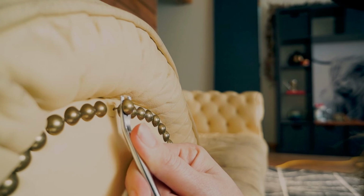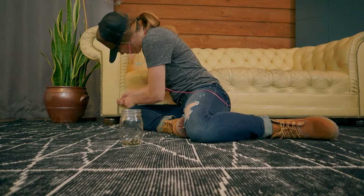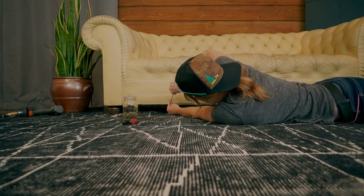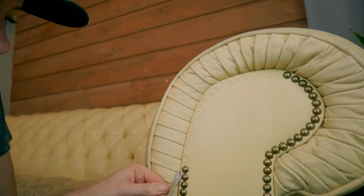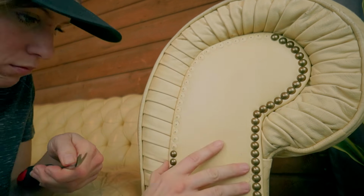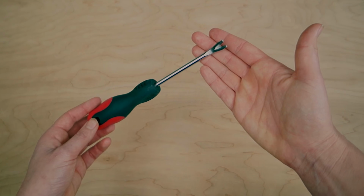Now you could leave them in and use a paintbrush to go around the hardware, but this couch has a ton of brass nails and they're all super close together, so I decided to take them out. I borrowed this tool from my husband. It's actually used for removing interior car door panels, but it worked really well for removing the brass nails, so I'll put a link for that in the description.